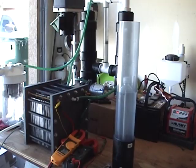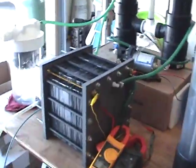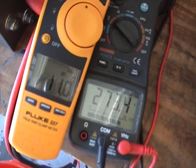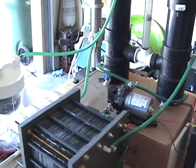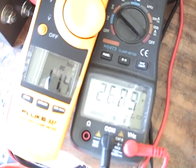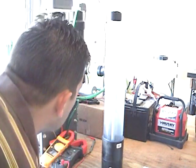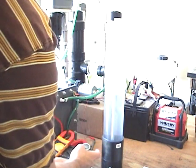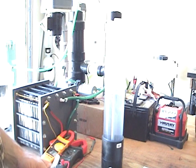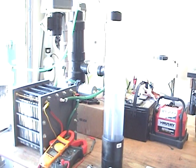As the amperage raises up with temperature, I am going to take a liter per minute test. Right now we are just going over 11 amps. As the temperature goes up we are going to get more amperage, and hopefully we are going to hit that 30 liters per minute. As it sits right now we are looking at about 13.4 liters per minute. Now we are hitting 11.4 amps — I am going to go ahead and take another test. We have got 3.78 seconds, 11.7 amps, 268 volts. That works out to be 15.8, just about 16 liters a minute.